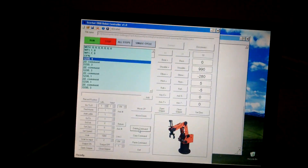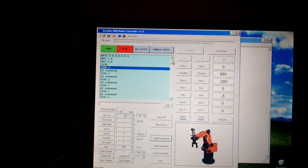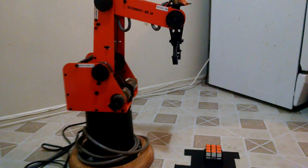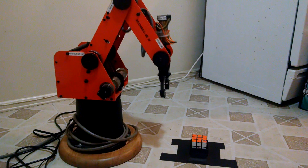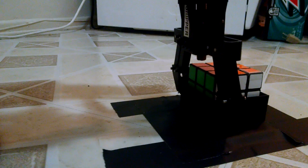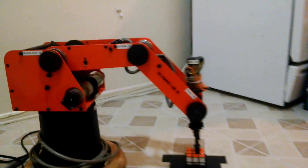Here is a quick shot of what the software looks like. I have the screen over here where the commands go. I'm just going to go ahead and run this right now. At this position the robot is setting up to show the position that the gripper should be next to the base. The back of the gripper needs to line up to the back of the base. Now I'm going to go ahead and press input 1 and the program will continue.